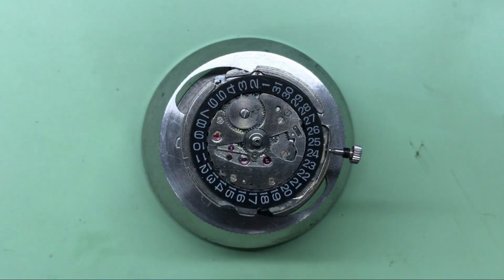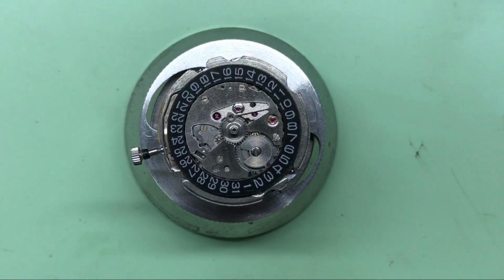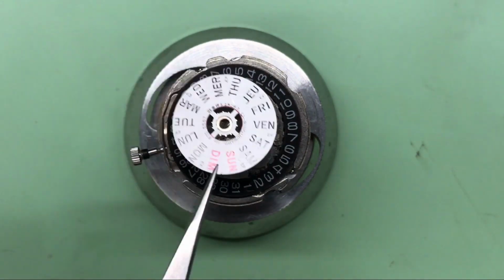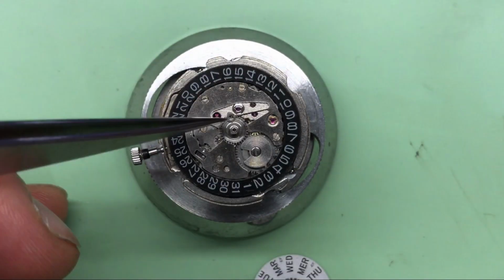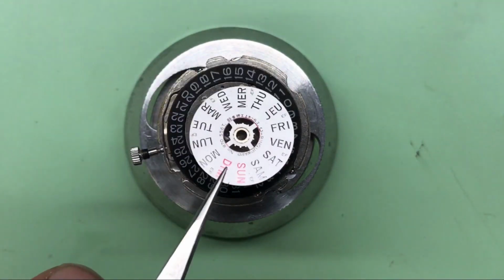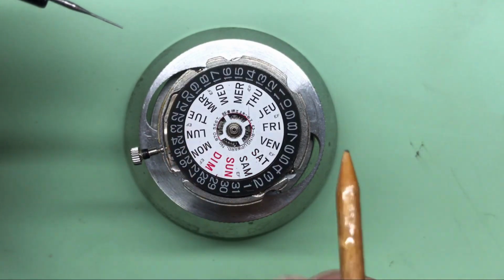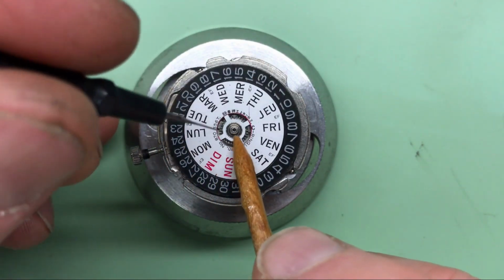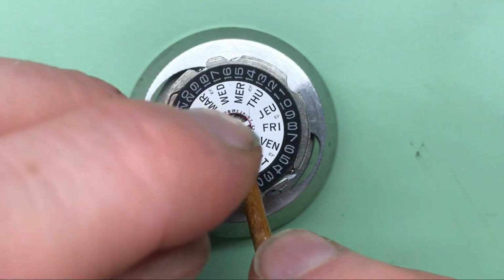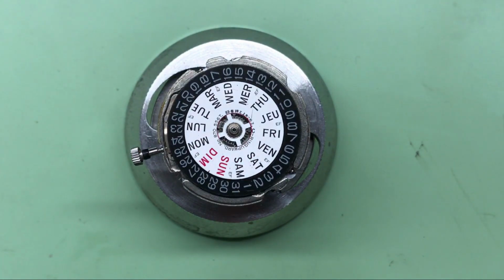Okay, the screws are now fitted and I've decided to go onto my other movement holder. Losing my temper is not a good thing to be doing when you're building somebody else's watch. So we need to look at this spring here, because there's a gear on the bottom and that gear is what that interferes with. So we place it on the top. I use an old oiler, bit of pegwood, hold it in place, and then through this little access I can push that so it then takes position.